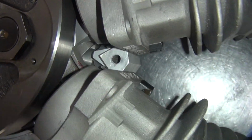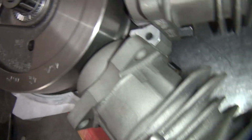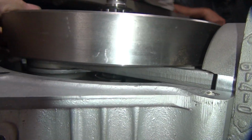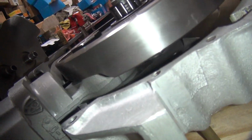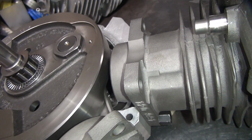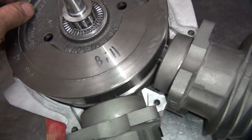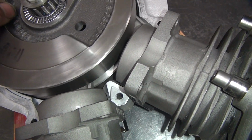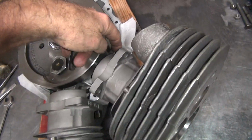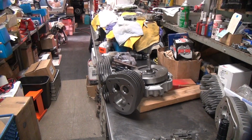So now we gotta make sure we look for our clearance right there. So we go down around, we hit. Can't see. Whoop. Buried in there. So you still can't see how close you are in there because it hits on the bottom. It's hitting down the side here you can't see, that's why. But it's definitely hitting on that. Okay, so we're pretty tight on these back clearances on the rear cylinder. Front we got more clearance and everything. So these clearances here are a little bit snug, but they clear. If your rod's hit on those spots, it's because there's a bad rod in the motor.